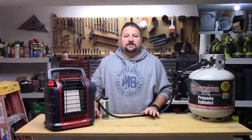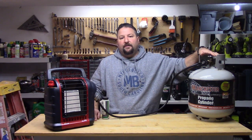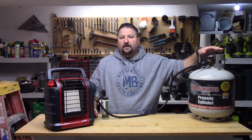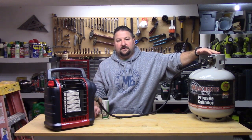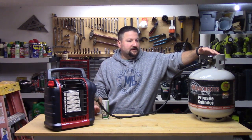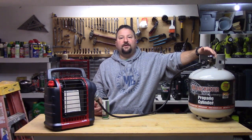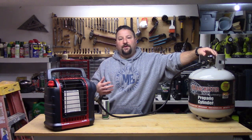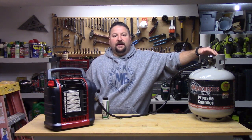Okay, so some things to consider, especially when you're hooking up a 20 pound tank to this. Make sure you leak test your fittings. Soapy water works fine. They say don't bring one of these tanks inside. I get that, but I'm heating my garage. So I've got it in my garage to run the heater. It's how I do it. You don't need to do it that way if you don't feel comfortable doing it that way. I'm showing you how I do this in order to provide a heat source in my garage.